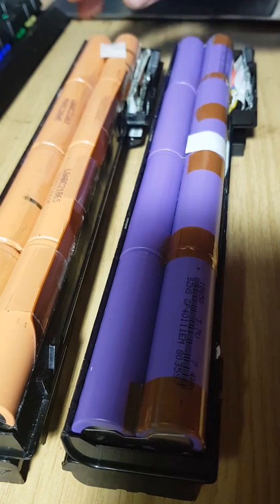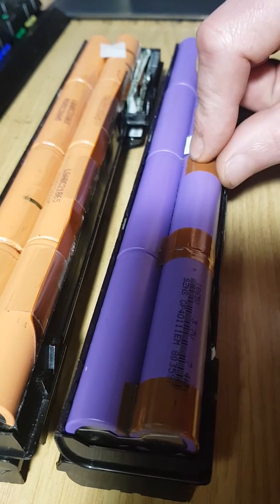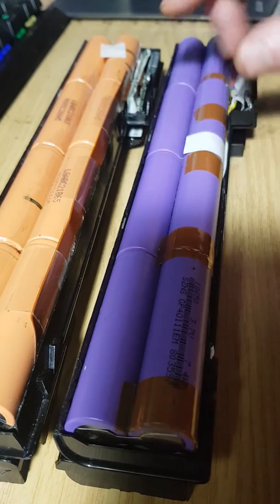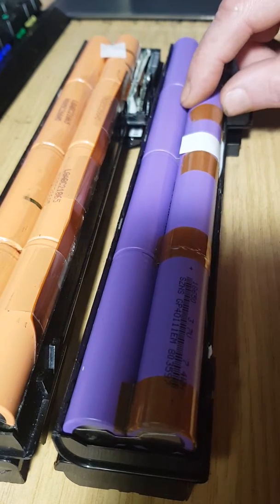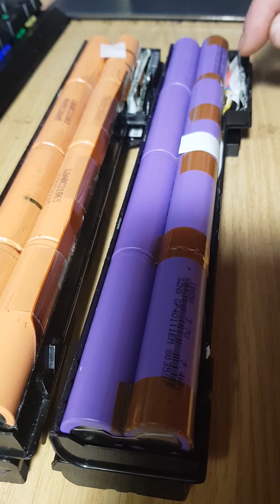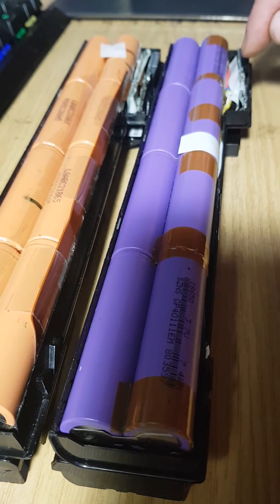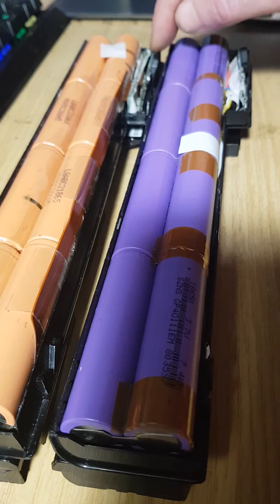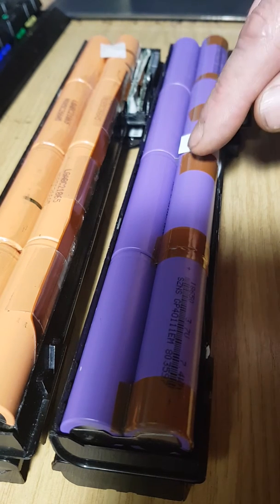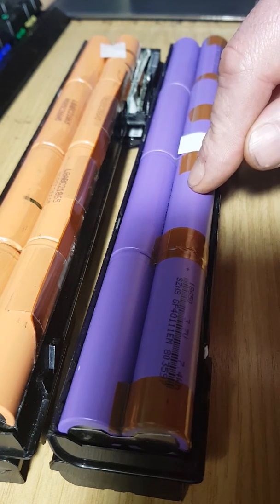Very difficult to get hold of, I've tended to find, because the most common ones are all basically lithium cells on 4.2 volt constant voltage charge. So one has to pay very close attention to exactly what cells are in your pack, which allows you to figure out what type of charging curve the smart battery's PCB circuit is going to be charging these at, because you certainly do not want to use a circuit like the one on the HP battery to charge 4.2 volt constant voltage charge cells, which of course would cause considerable issues.